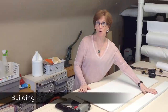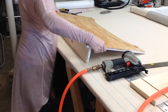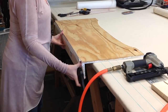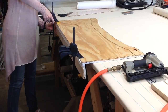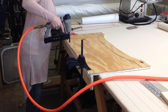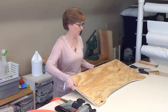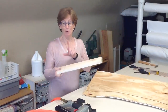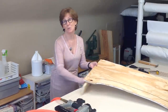To build the cornice, I start by taking my dust cover and my face board, setting them upside down on my table, and then clamping the dust cover up underneath it. Now I add the legs — and you need to remember to place the groove on the outside. That's an easy one to miss.